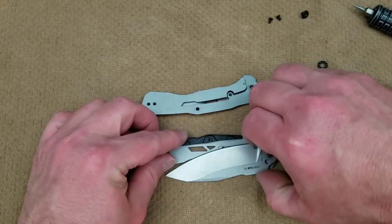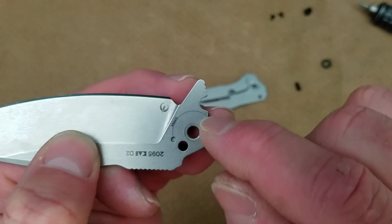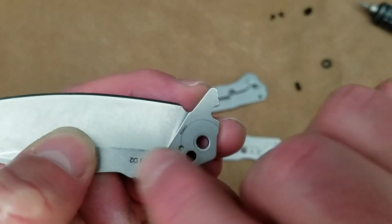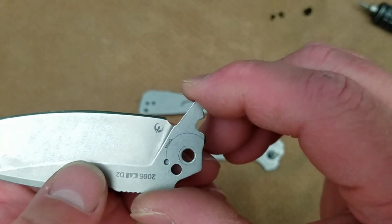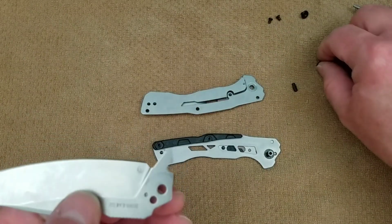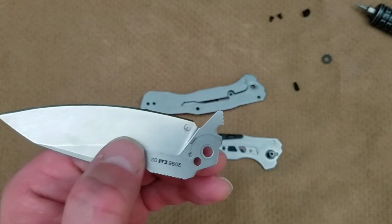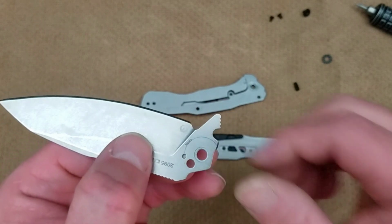The first one we will look at that was causing that sensation of a gritty pivot is this. The detent track on this blade, where the detent ball rolls, you can see plainly here, it rolls through the etching for China. Well, these etchings feel smooth to my fingers, okay? But at a microscopic or micro tooling level, excuse me guys, there is some texture there. And when your bearings are this doggone small, that contact area almost acts as a multiplier to sensation. It makes what normally you would not feel at all into something that you can feel.